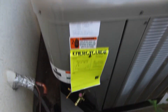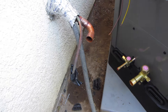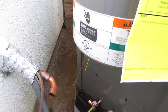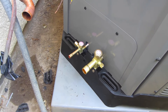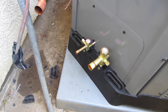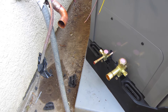The 3-ton has slid in. I brazed my 90 on here because it's going to be a little bit tight. I'm dealing with the bush right here, so I'm going to have my 7/8s come down here and whip in. That's actually 3/4 — I'll just reduce it down. It looks a little funny, but tight quarters.